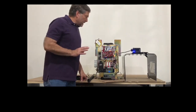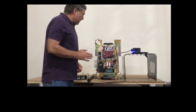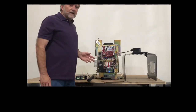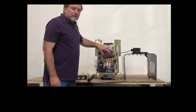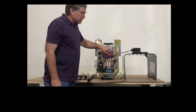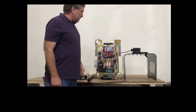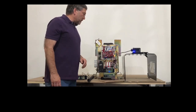It's also important that you let the gate run through one full cycle, open and close, before you make any adjustments or test your safety devices, interrupting the beam of the photo eye, anything like that. Because during the first cycle, the machine, the control board, is figuring out what the normal resistance is on the gate, so that the force reversal will be adjusted properly. And that's about it. No lights flashing means your gate should be able to move open and move close.